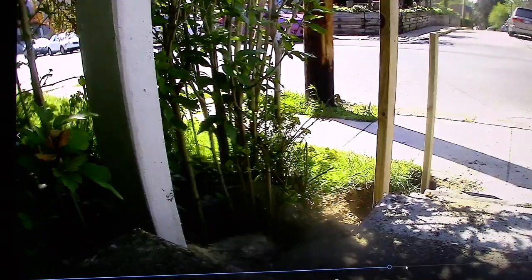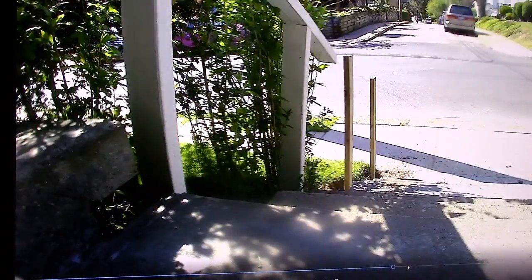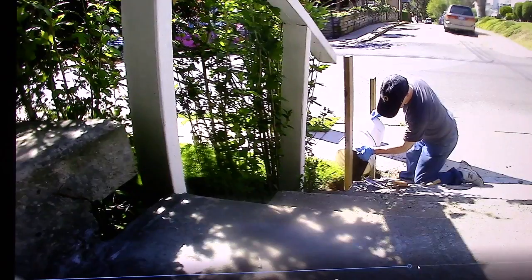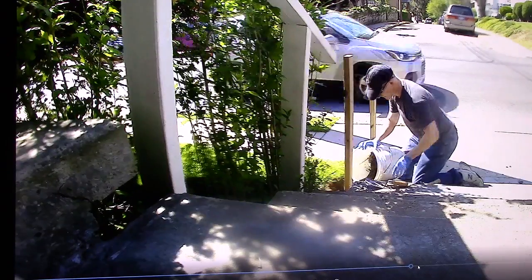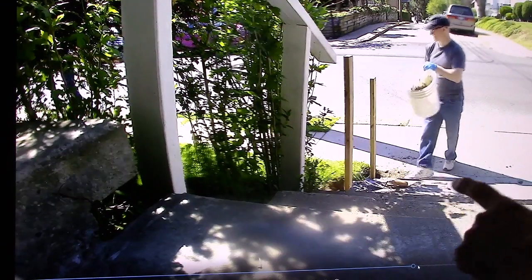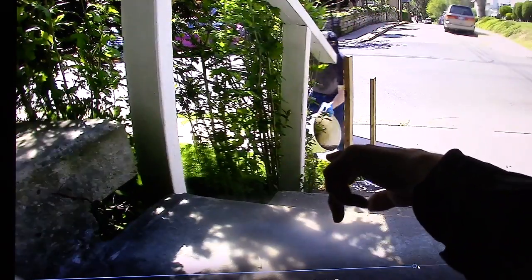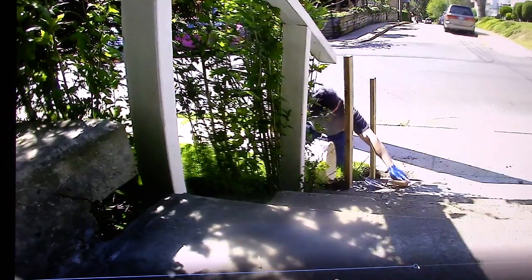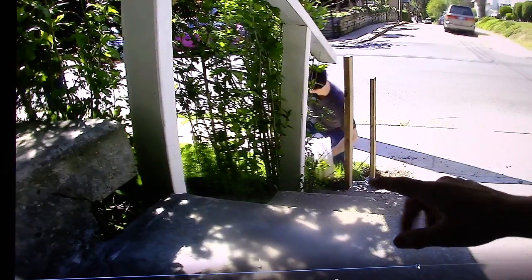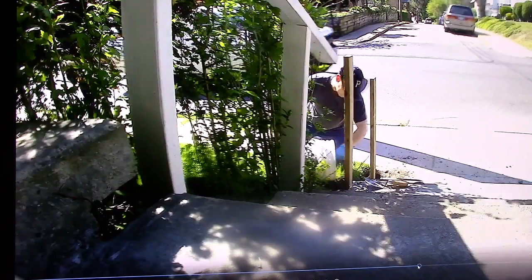Basically, take your trowel and draw a line. If the line stays there, it's pretty good. If it's powdery, add a little more water. I got it to the point where I could pour it — you can see how well it pours here — and then I just scrape the rest out. Now I'm going to show you all my mistakes. Here I am talking to my neighbor, trying to get the rest of this batch of concrete out. I did several batches with my hands — I'm only using nitrile gloves at this point.